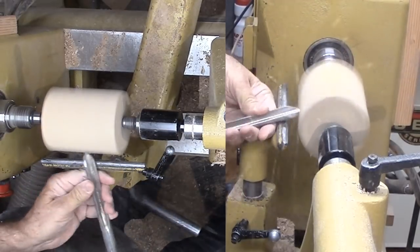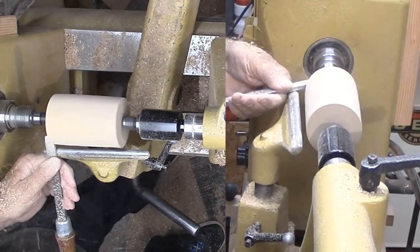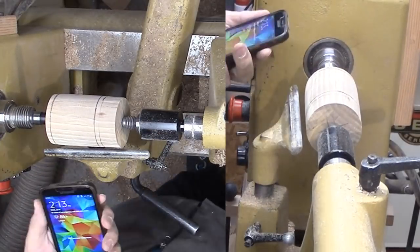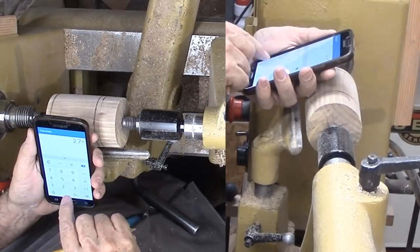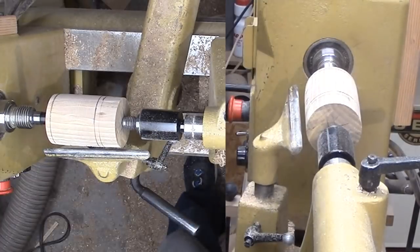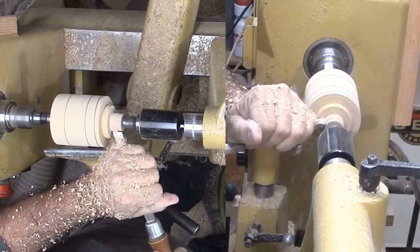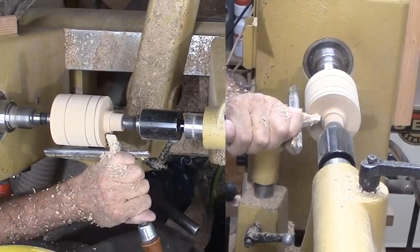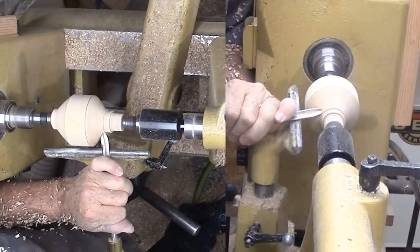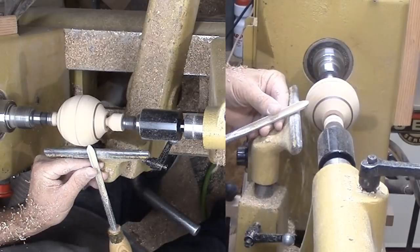Now for the sphere I'll use for the lid — another piece of gum wood. I'm following the same process as my detail video: first round it off and measure the diameter. After marking off the key points, I decided to shift a little. New marks are easy enough to mark for ends and corner points. Then trim down the ends to a diameter equal to the side of my octagon, then cut the 45-degree sides down to the end tenons, and finally rough off the corners to my rough sphere.